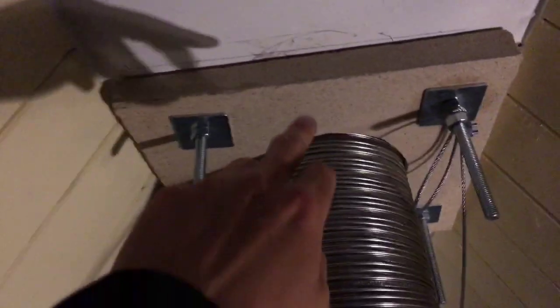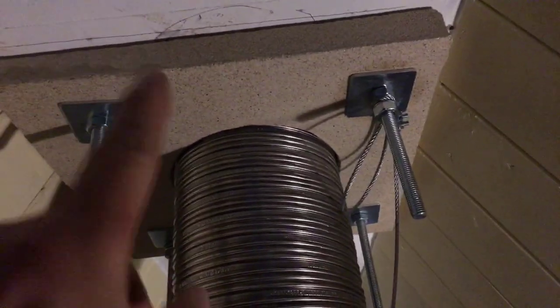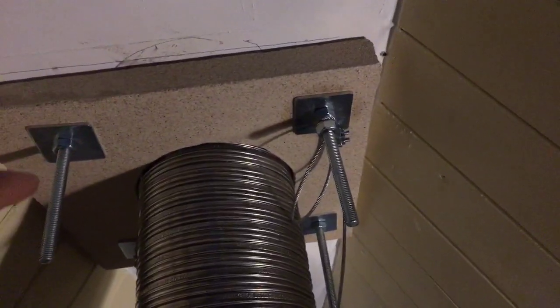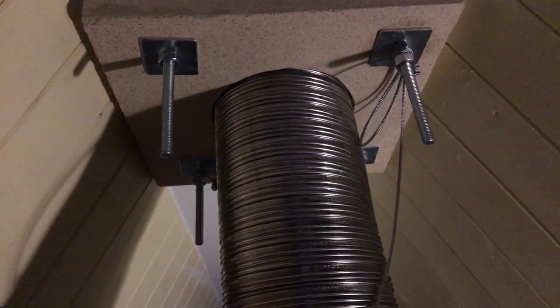It's the Roder TG-170 that you saw before, with all the connections that I showed you before. There's the gas line, but I've got a fan which I'll show you in a minute. Basically what this is is a fire brick, 30mm thick by 30cm square all around. It's held upside down by four bolts which go through the chimney collar at the top, and there's a cowl on top — an anti-downdraft — which I'll show you at another time.